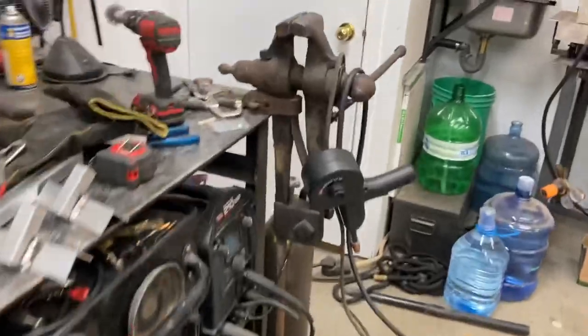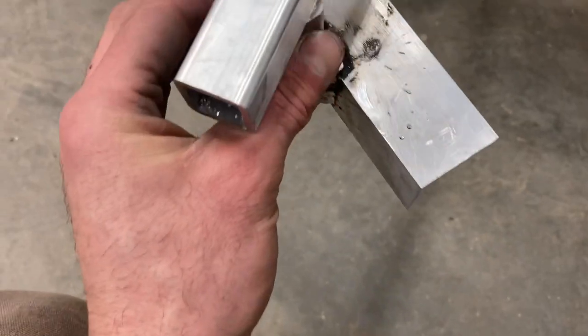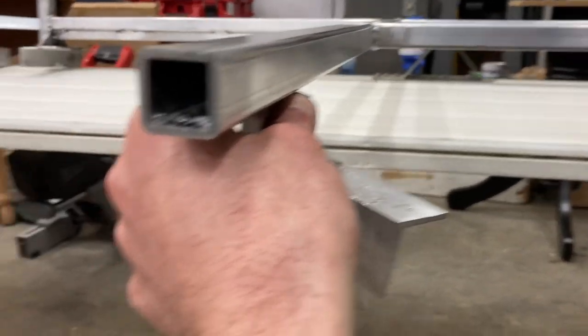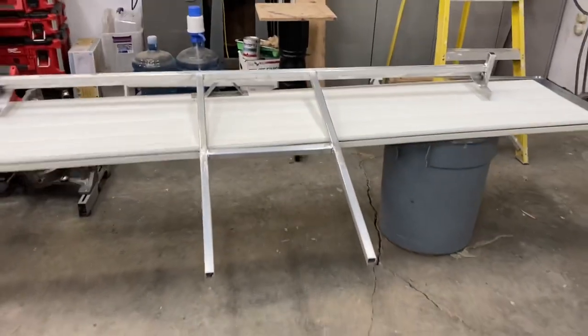I've got two little jack posts. These aren't very pretty. So that cone, it turns and comes around. And so these two will attach on the front at some sort of angle. Then I can just weld that. And that'll support them. They'll be back a bit, I think, like that. And then that's the horizontal portion. And then the vertical ladder will just weld to this and run straight down to the trailer frame where the hitch is and mount onto there. So we'll see what that looks like.